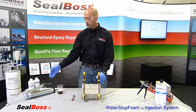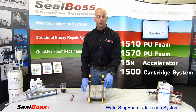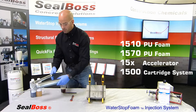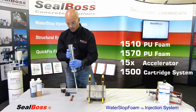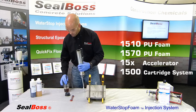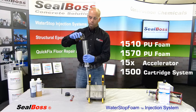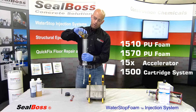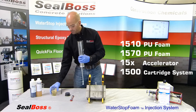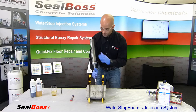Now we're ready for a successful injection via use of the B-Gun 162. We've simulated a wet environment by adding water to our block mockup and set our injection port. We're going to get right down to the nuts and bolts of doing an active urethane injection with use of the Seal Boss 1500 lever activated gun. We'll do a bulk load by removing the back plunger from the gun, holding the gun upright or upside down, and removing the skin on top of our catalyzed batch to allow it to be added to the gun. Then I'll connect the end of the gun with the four-claw Zerk coupler to the Zerk fitting on the injection port, take my plunger back, put it on securely, and begin pumping.